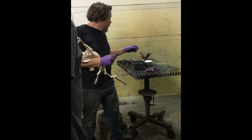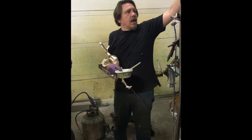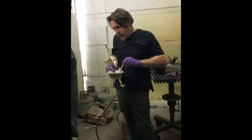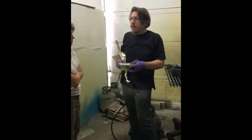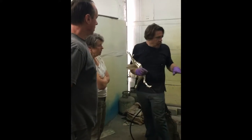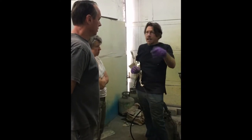And then we're going to use this, which is just like if you buy titanium paint for your house or whatever. This is just powdered titanium without any pigment in it. And it's the same way. It's laboratory-induced rust on the metal titanium. So it becomes titanium dioxide. And that's how we're going to get the caramel colors. We're going to alternate between black ferric oxide, titanium, and nitric acid to get the effect that you guys are looking for.